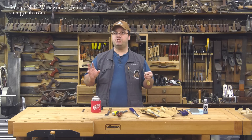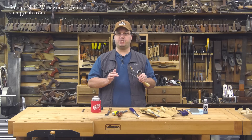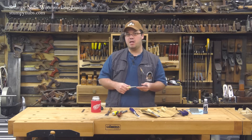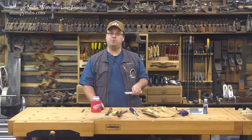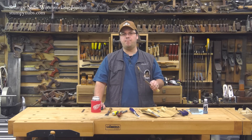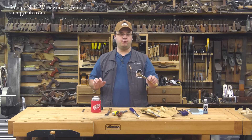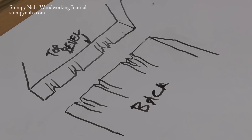If those scratches are really shallow and fine, then the effect is going to be minimal — that's fine. If one or two deep scratches are there but not a ton of them, that's not a big deal either, as long as they aren't leaving grooves or ridges in your workpiece. But a lot of deep scratches left behind by a coarse stone — that's a bad thing. There's a reason people shave with a razor and not a bread knife. My point is your edge is only as fine as the coarsest of the two planes that make it up. If you get perfectly polished on your bevel but you've got tons of deep scratches on your back, well, you've wasted your time on your bevel.